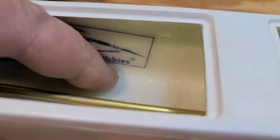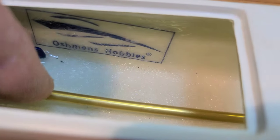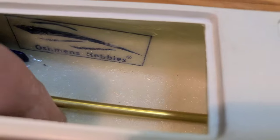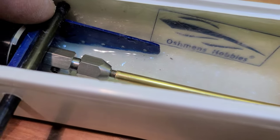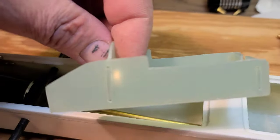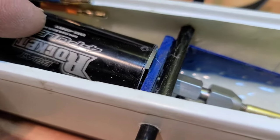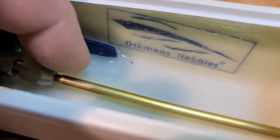The stuffing tube is laying flat on the bottom of the tub right here, and where it starts to ride up — that's the AOA — the stuffing tube is actually hugging that angle of attack. That's why I made this motor mount special for this boat and didn't use the stock one. I had this specific angle that I found for it and it's working perfect.